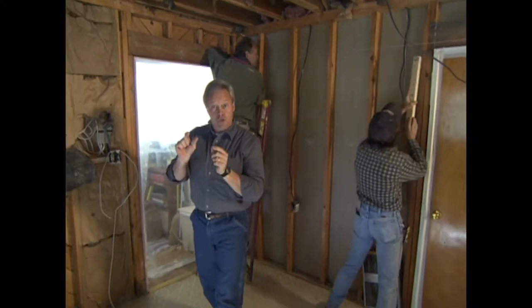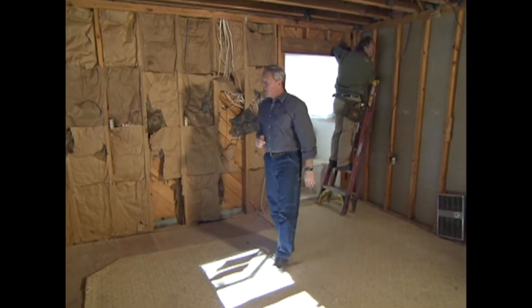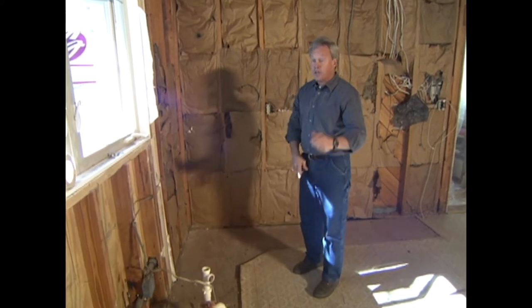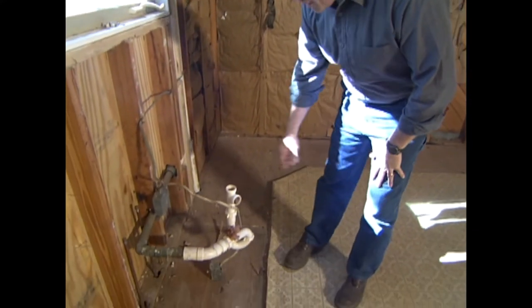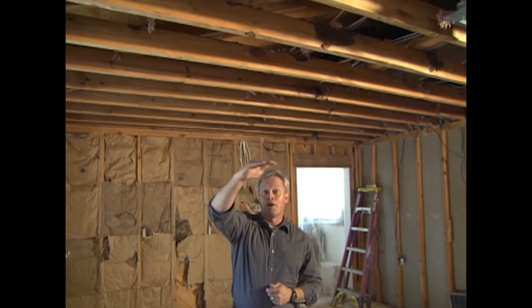It's not uncommon to have to take a strip of wood and rip it down from, say, three-eighths of an inch to over an inch. We try to remove all of the walls in an extensive renovation like this for several reasons: it allows us to straighten the walls, and it gives full access to the electrician and plumber. The plumber has a little work to upgrade this old plumbing for our new kitchen sink, and our electrician has a lot of work because we'll have a number of switches and outlets added, plus code issues to deal with in order to upgrade several electrical circuits, and a lot of ceiling lights going in — not only the kitchen, but right on into the eating area.